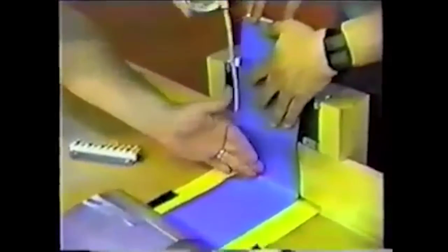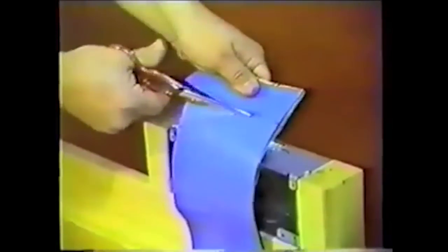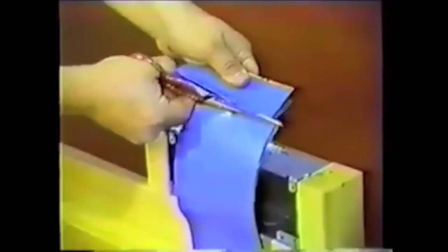Using sharp cutting shears, measure and cut the cable 3 3/4 inches long, measuring from the bottom of the box to the top of the cable. The cable will now be the correct length to terminate the cable to the transition block.